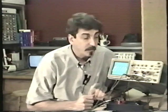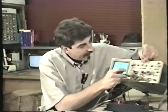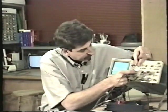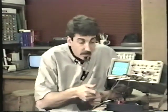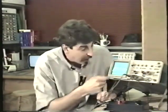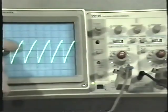But suppose you do it this way. You get one good calibrated unit. You adjust your volts per division control so that you have instead exactly 3 divisions, let's say. You really want to make it as large as possible. So you have exactly 3 divisions. With that calibration knob set there, whatever piece of equipment you're working on, you adjust the pot on it, whatever it is, so that that waveform is exactly 3 divisions now, which is much easier to visualize than what it really is, which is 3 main divisions and 3 subdivisions.